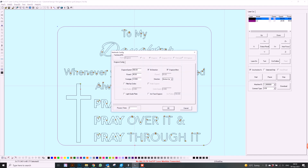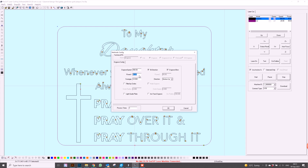I'm going with a speed of 500 — it's always my basic choice. For power, I always recommend going between about 30 and 40 percent. If you go any more than that it will definitely start melting and your sharpness will disappear. Today I'm going for 35 percent power, and my scan gap I'm going to leave as is because I want a really crisp engraving.